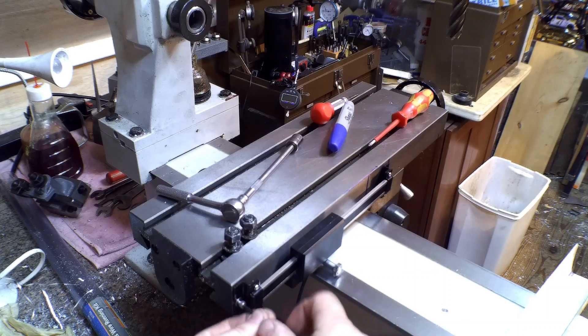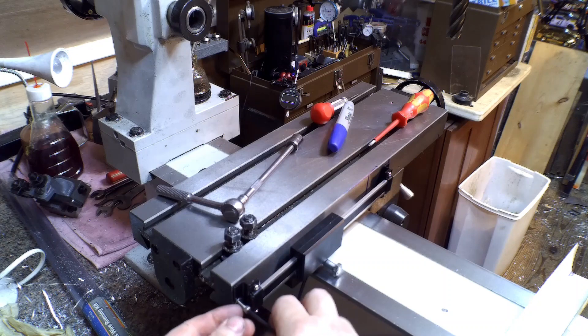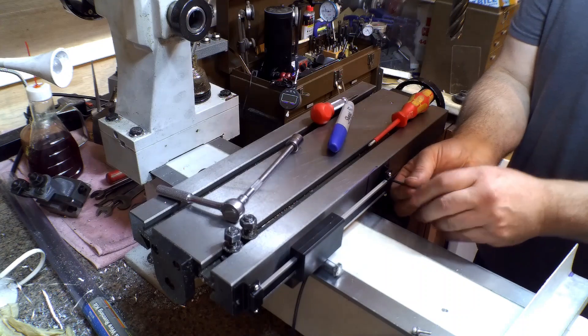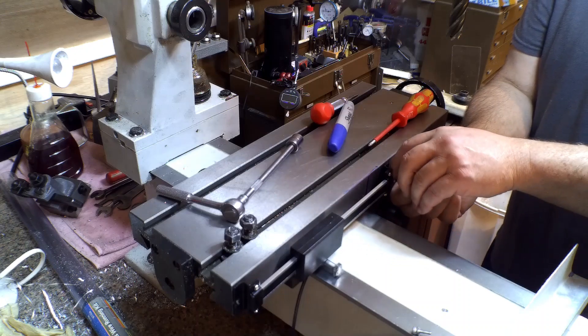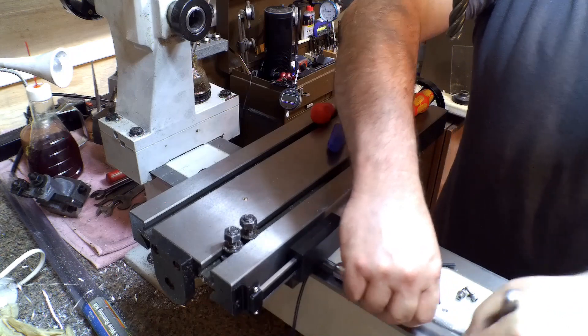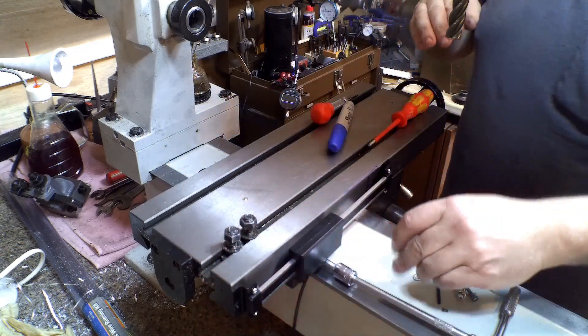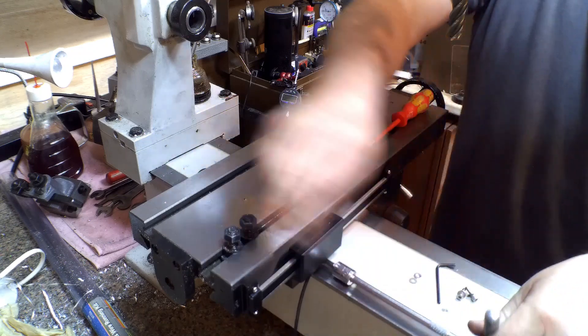These little four millimeter stainless steel screws - I use the same ones underneath the table for my positive stops so I can't crash the scale. That's right underneath, basically right where my fingers are underneath. Like I said, I've lost about an inch of travel. I do have two little washers to space out the scale, and I designed the thickness of the spacer on this bolt to space it out because I knew I'd be building a shield to tuck underneath it.